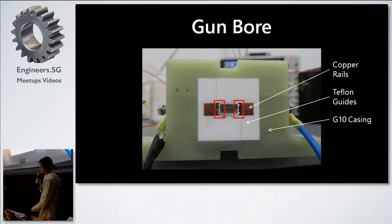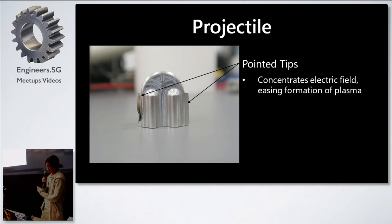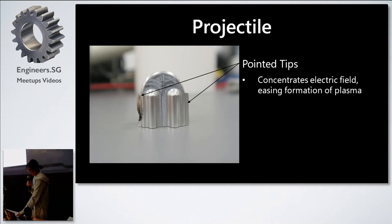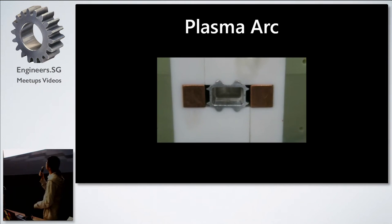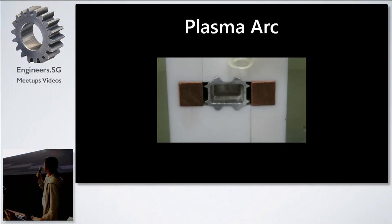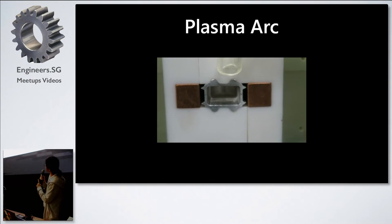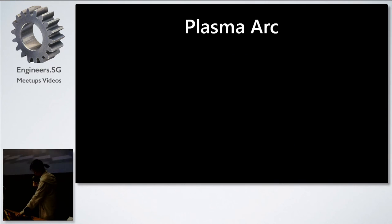You can see the wires which are the input and output of the current. This is our projectile — $150, very expensive. It was precision engineered with conductive guides to help concentrate the electric field so the plasma can arc up easily, requiring less voltage. The first thing we did was check if the plasma could actually arc. We flushed helium gas through it and the blue sparks are the plasma arc — at about 400 volts. Proof that we can get the plasma to arc at 400 volts with helium gas.